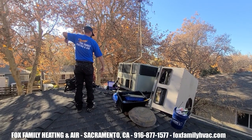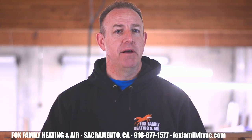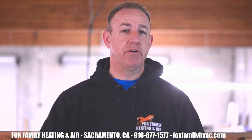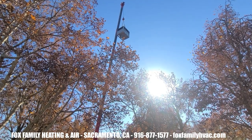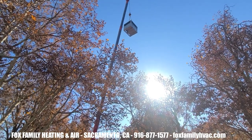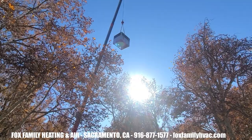For the most part in residential package unit installs on the roof of a house, the crane operator can see the spot that he's placing the unit at — maybe not the actual footprint of the curb itself, but experience creates a comfort level for the operator to get the unit pretty darn close to where he needs to be. There are other obstacles the crane operator needs to navigate through. Straps hold the unit secure as the hook holds everything together on the way to the placement. Sometimes there are trees, a giant radio antenna, or even high voltage power lines that need to be avoided as the unit gets lifted to the rooftop.